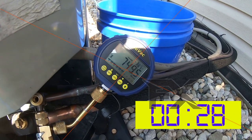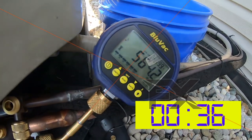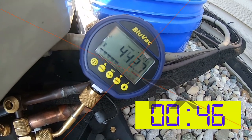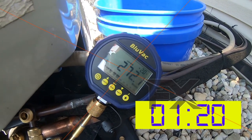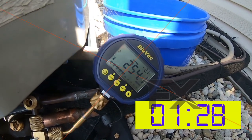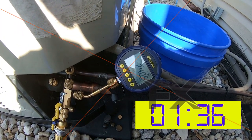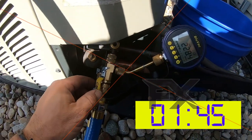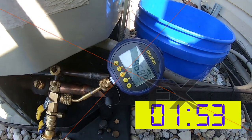You need to start the clock wherever you want to start the clock. There's your .500 magic. Now, you've got to remember — I'm sure you guys have seen it a hundred times — it's not just get below .500 and open the valves and let her rip. It's blank-off time, to see what exactly happens. If you've got a leak, she's going to continually, steadily rise. If it's got moisture, oil, refrigerant, whatever — she'll rise some and eventually level off. You're going to have a little bit of air stuck underneath these gauges, as you've just seen it jump up to 1,200. She's going to bounce right back down again to that 2-mark here in a second.